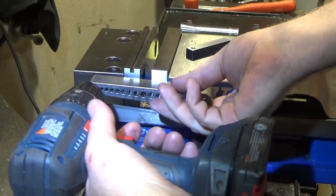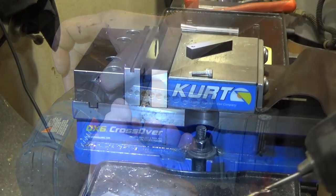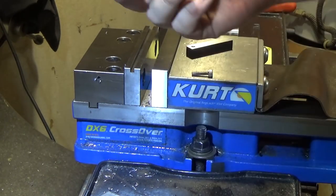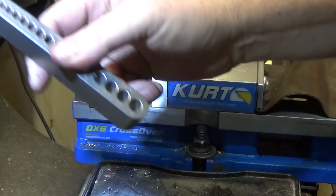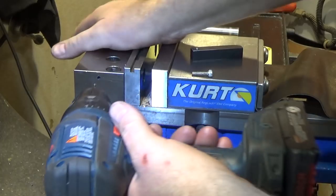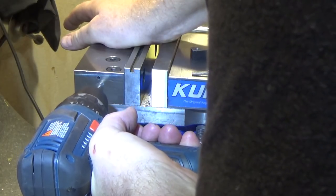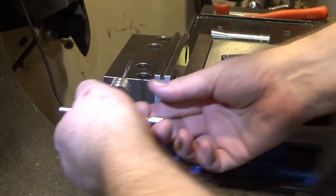The jaws are even, but the back piece is hardened — I thought it was going to be a lot softer. This first drill bit size is undersized; here is the tap drill size. I purposely went with the undersized drill just to get a good pilot. It only comes in fractional size so I went with the fractional size that fit. Next up, just tapping 10-32.